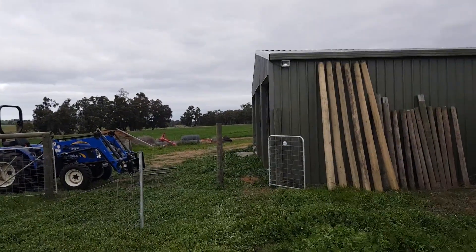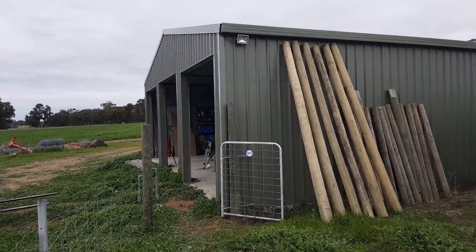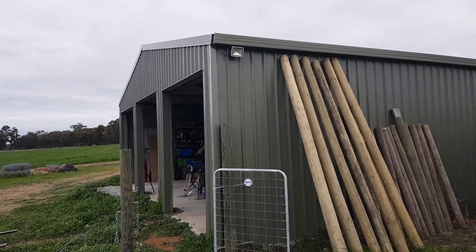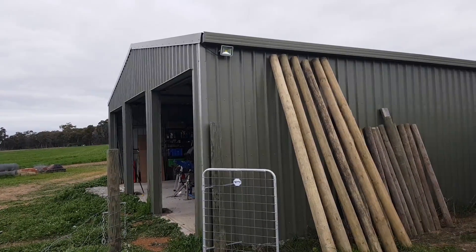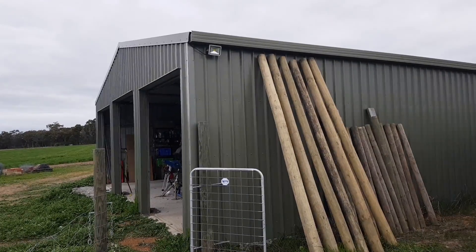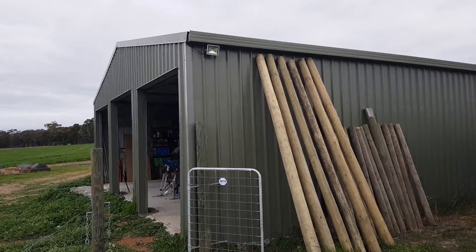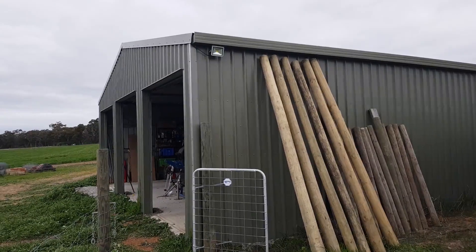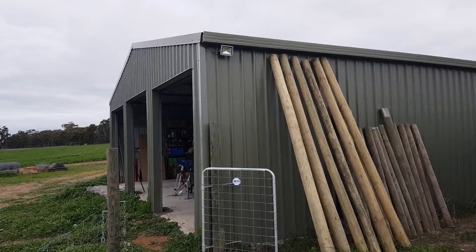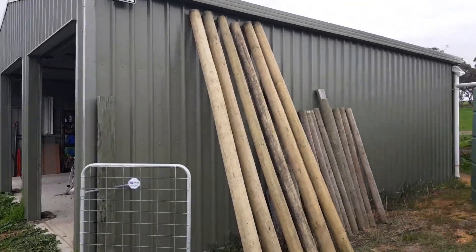Here's just a little hint before you get too involved in sheeting in your shed: your roof has to overhang your gutters, and it's a bit tricky to get all the fastenings on once the roof sheeting is on. My recommendation is to sheet your walls first, get your corner trims put on, then do your roof plumbing. Once the gutters are all in place, you can put your roof sheeting on and put on your ridge capping and your flashing. If you do it in that order, you won't have any surprises.